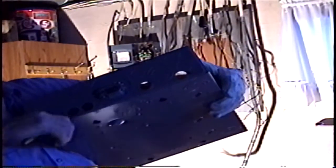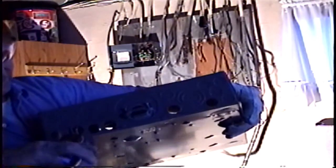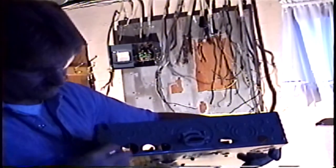Removal of concentric knockouts: they are presented by the concentric rings, more than one. As I take my dikes, just fold these back and forth a few times. Yeah. Look how easy that is. And you just made a half into a three quarter.